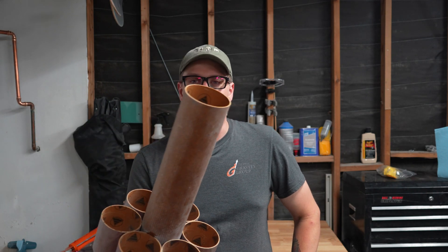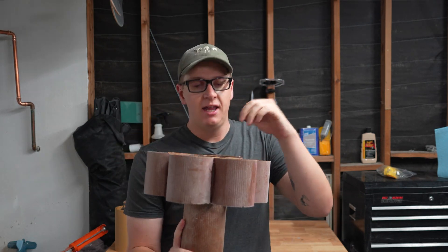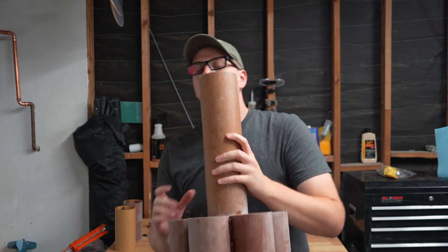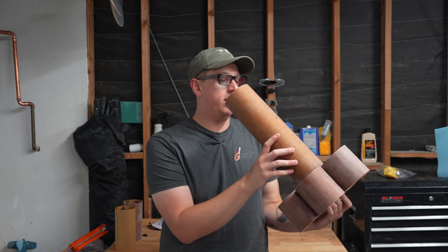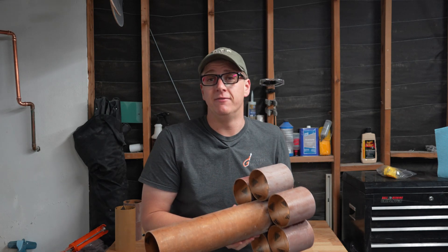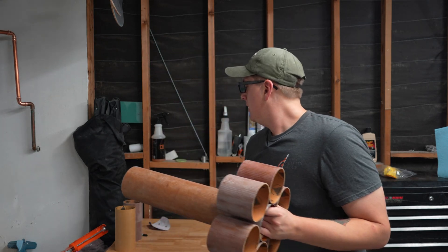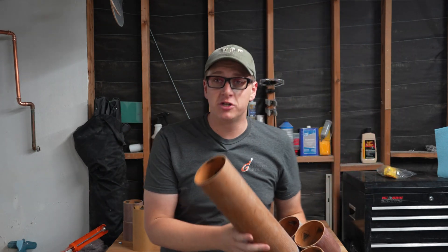Finish being subjective because I don't know if it's gonna get painted or not. There are a couple odds and ends that I need to work on. Since you saw it last time it now has a motor mount in it — that is a 75 millimeter motor mount. It kind of dawned on me that I might be pushing the phenolic coupler a little hard if I ever wanted to truly put a hard-hitting 75 in here like a four grain or like the L1940. So I've decided we're gonna reinforce the coupler, and a great way to do that is the balloon trick — where you put fiberglass cloth inside your coupler and inflate a balloon.